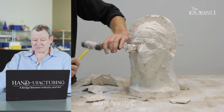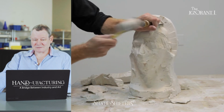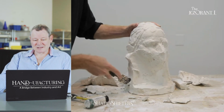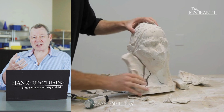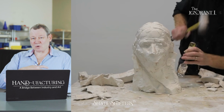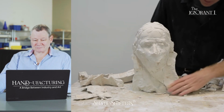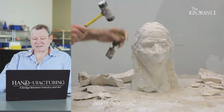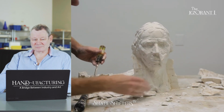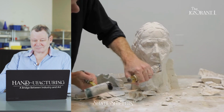You want to be careful of this part. He's finessing, right? And he probably poured a much more dense hydrocal into the mold. You want to have your casting be a harder material than your mold. As much as possible, you want to remove pieces of the mold from the thick shim edge. At a point, you'll have to remove some of the thinner sections by chiseling. I like his work, is what I mean. And you want to make sure that your chisel doesn't gouge the plaster cast underneath.